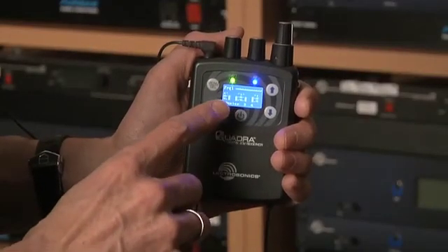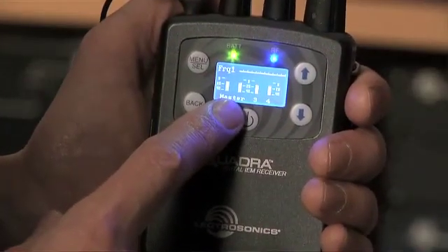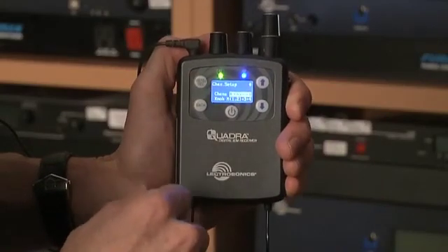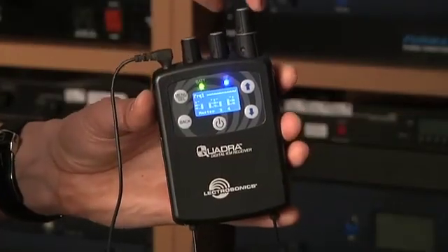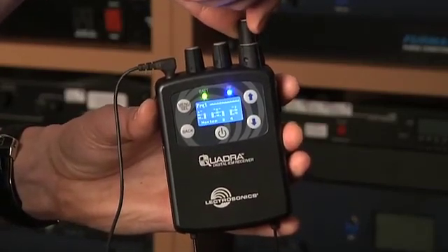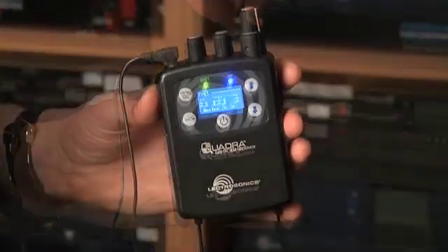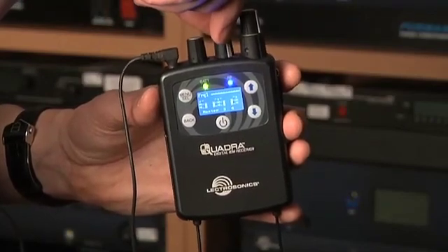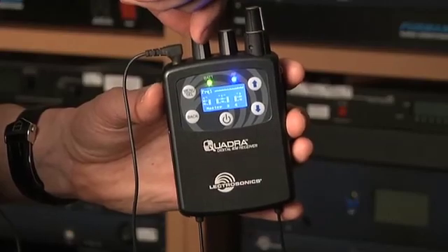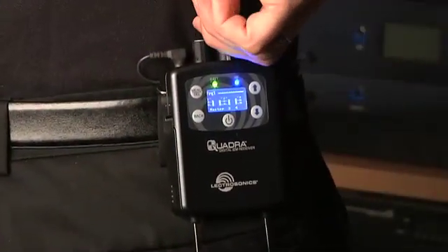So let's take a look at how this interface works. You can see activity on all four channels right here in the display. Menu options give you the opportunity to adjust listening parameters, including the mixer layout. In the default setting, the tall knob here is the master stereo volume, which is used in the same way as with any standard IEM receiver. In this case, we're sending it a stereo mix of bass and drums on channels one and two. These smaller two knobs then allow you to turn up or down channels three and four independently, which could be whatever you want, like guitars in three and your vocals at four. This way, if you want to make adjustments from song to song, it's under your personal control.